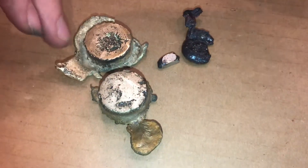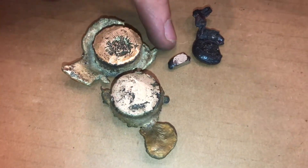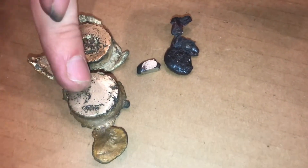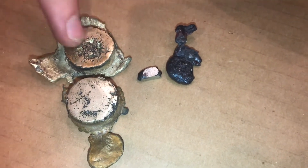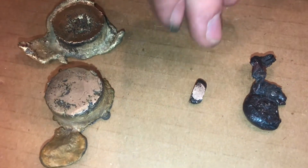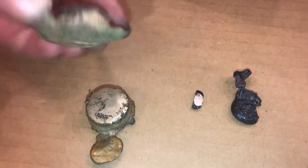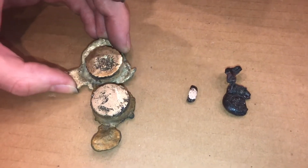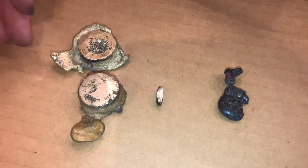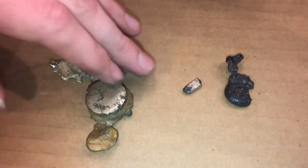Here it is next to some other alloys I've made with combinations of zinc, nickel, and copper. This one has a really noticeable, almost pink rosy color to it compared to a lot of the other ones that are very yellow — almost pink looking. Something else different about this alloy is that it's a lot softer. The ones with zinc, tin, nickel and all that are more bronze-like and pretty hard and difficult to cold work. This one I just pounded into shape no problem cold, but some of these will crack if you try to bend them too much. So I like the softness and the malleability that this gives me.